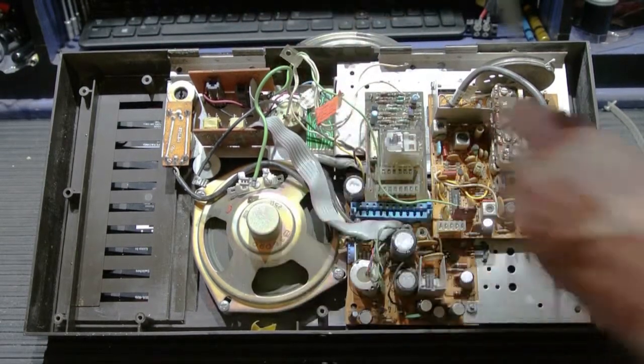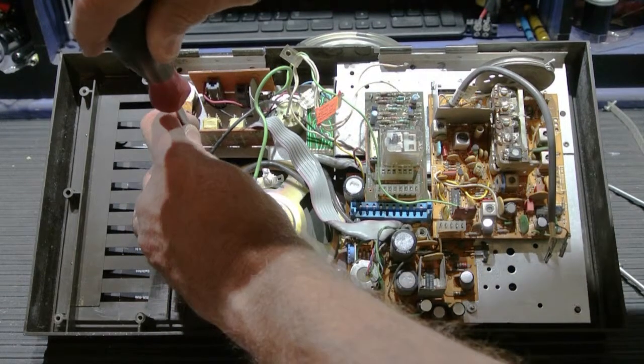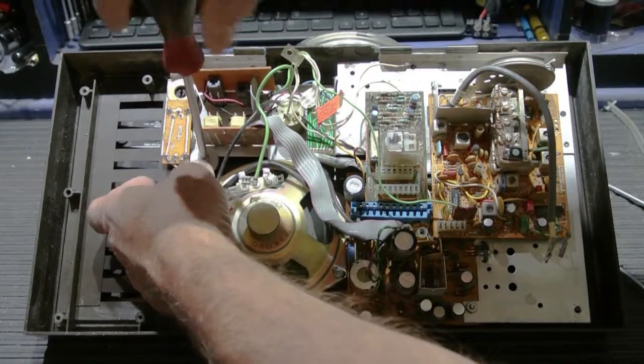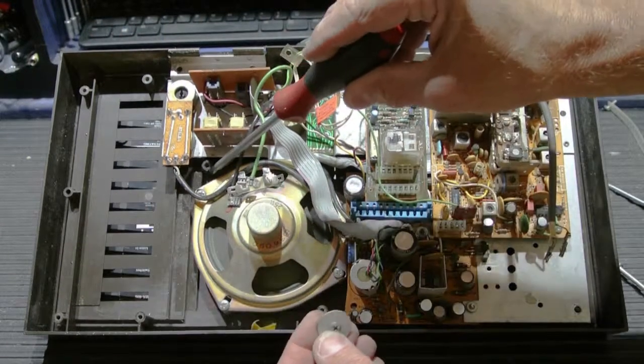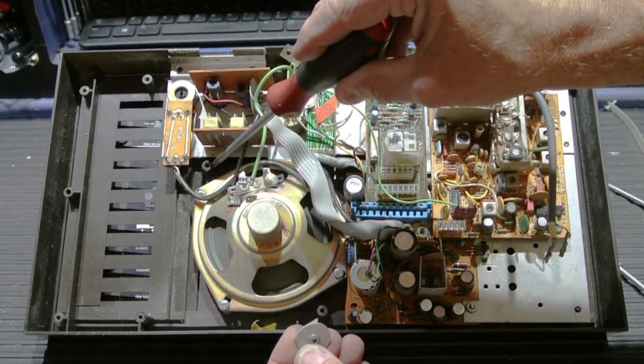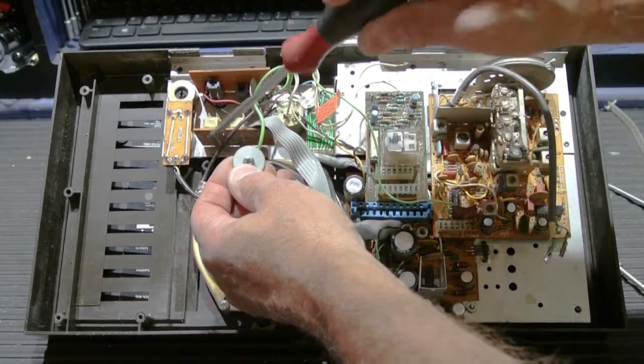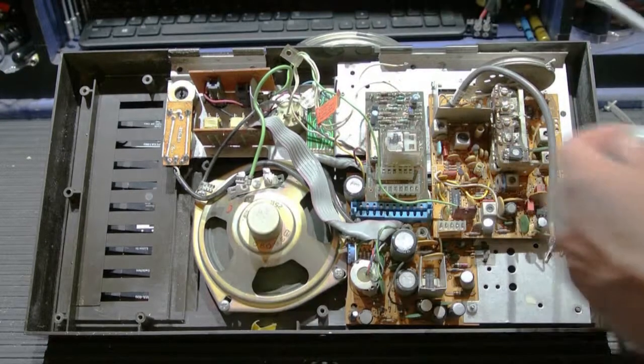And lastly, the screw with the big washer. The reason it has a big washer is because the screw goes in the standoff on the back of the plastic faceplate, which pushes down on the head of the washer, which pushes down on the chassis and holds it in place.